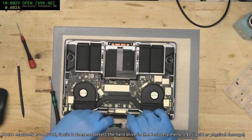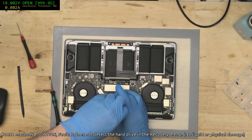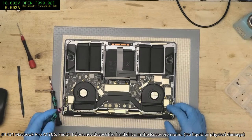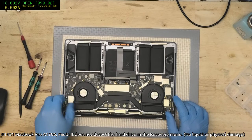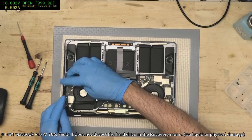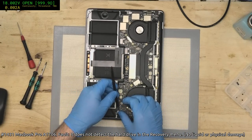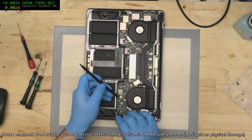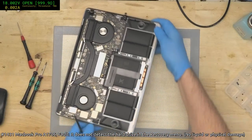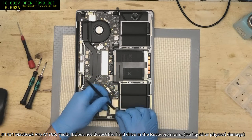Any updates on the T2 from last night? Well, I had a chat with Tim Herman and we bounced a few ideas around. And we're sort of thinking it might be the RAM layer on the T2. It's not exactly the sort of thing you want to try and remove, but might have to try it at some point. But you have to kind of convince the customer that it might be worth the risk. I think the hardest thing about doing that with the T2, of course, is reassembling the T2 afterwards with the new RAM module on it. It's a bit like dealing with an iPhone 6.